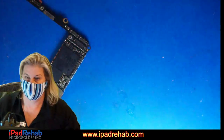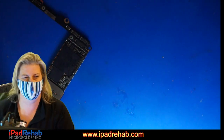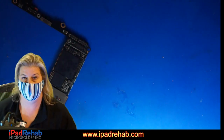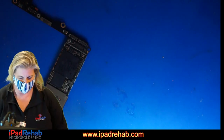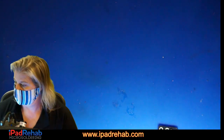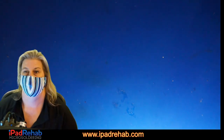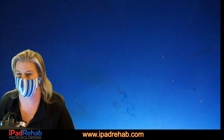All right. So, result. The only spot that seems to be kind of a hot spot, remember it's the thinnest wire that's going to get hot, is within the PMIC. But that's not going to be a failure point on this board, most likely. We're going to be looking for some kind of a problem where the water went, right? So let's look at this